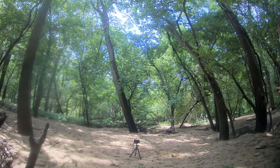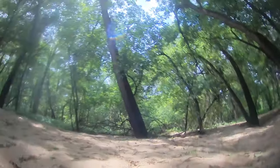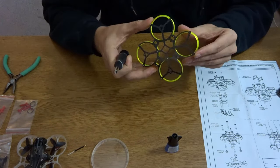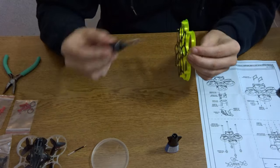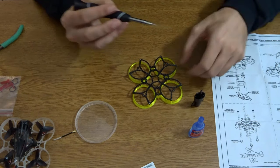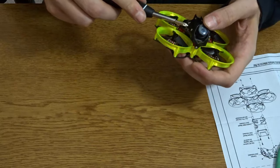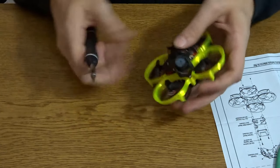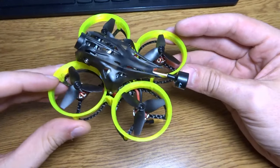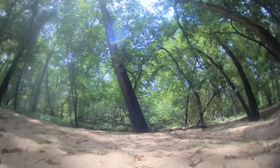As you can see from that short little clip, there's a crazy amount of vibrations going on with this frame. I went back through and checked all of the screws. I didn't show very much of the assembly footage, but when I was going through, I did put thread lock on all of these screws and everything is tightened to the point of just about stripping whatever we're tightening it into. And yet we still have this terrible vibration as you can see here.